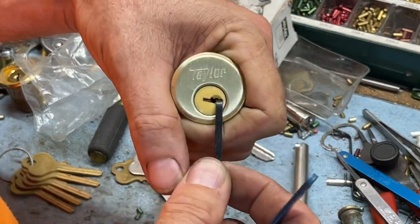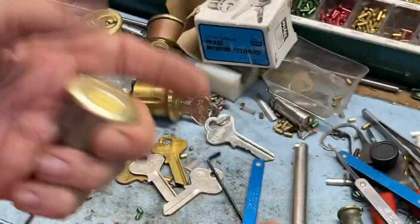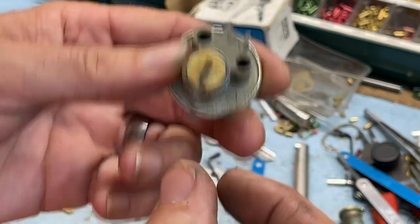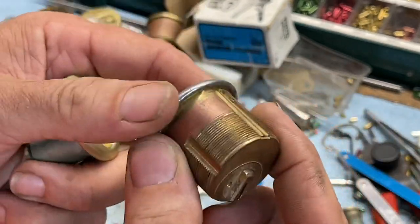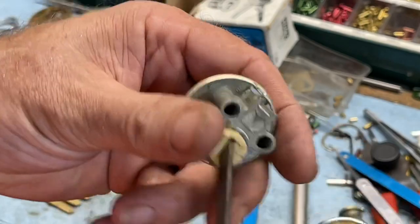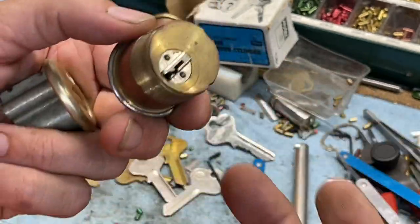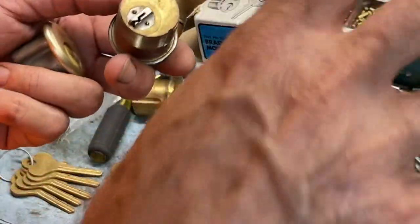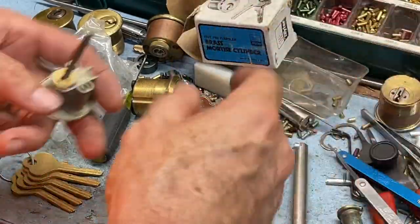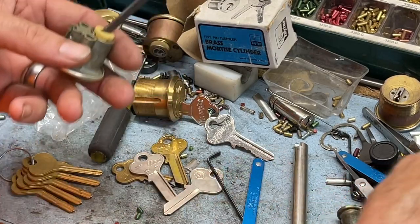Almost always you do have to replace it with another lock. However, that's not always easily done because on thin metal garage doors, people would cut just enough away to make this fit - using a half-inch drill bit in three places instead of a proper hole. You end up having to recut that metal, which can get irritating. Also, don't forget the plate on the inside would have to be replaced as well, but that comes with most rim locks.